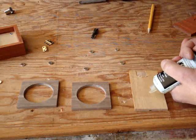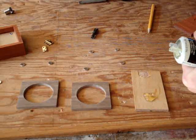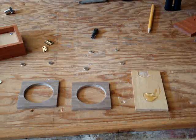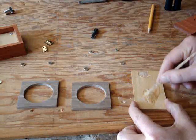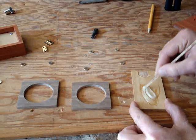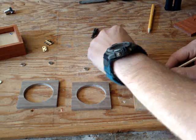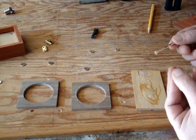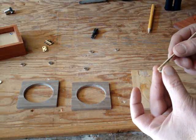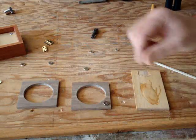To attach these magnets I'm just going to mix up a little dab of epoxy. I like to use epoxy for gluing anything that's not wood to wood. This is quick-set epoxy — you mix up the two halves and it'll dry in about five minutes, so you've got to work quickly. I've already separated my magnets, otherwise they just jump onto each other, and very carefully I should be able to dab just a touch on each one and drop it into place.